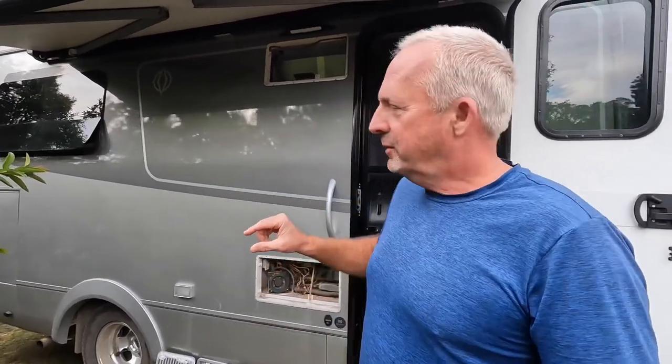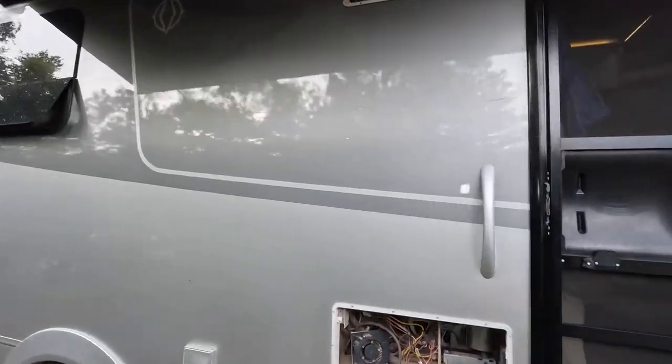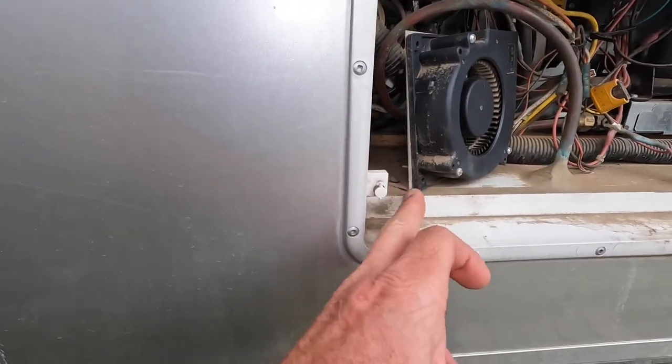So what the Fridge Defend allows me to do is it has a second thermometer, and it will monitor the temperature inside right on the coils, and you can program what temperature you would like additional fans to come on. They sell what is a giant computer-type fan, and I'll show you. This is the first one, and it spins, and it sits on a piece of sheet metal.